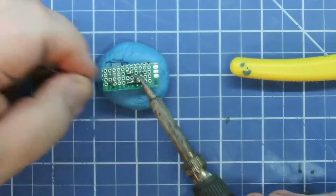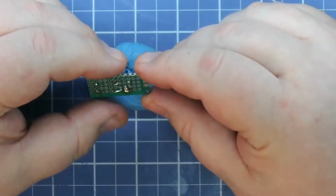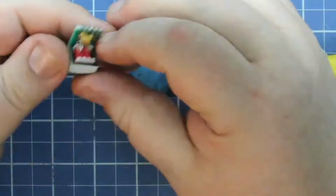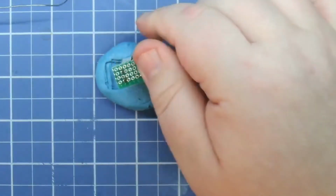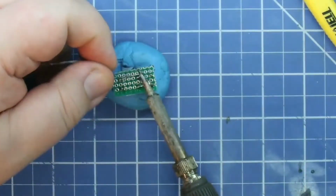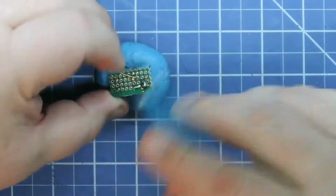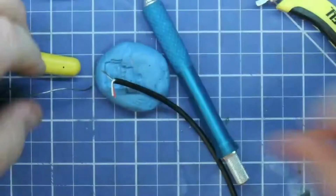The Heil website for Heil microphones talks about just using a 1 µF capacitor. Everywhere else I've read on the net says that if you want any bass to come through, go ahead and use like a 4.7. And so that's what I did, because I don't want to physically alter the audio. If I don't like the bass, I want to be able to take that out in the rig.